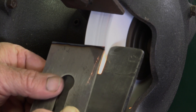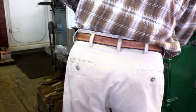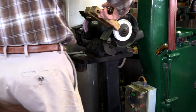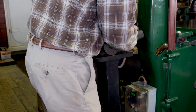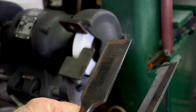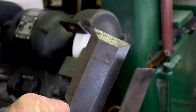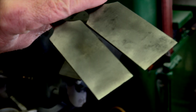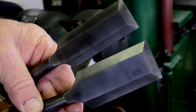One of the other don'ts is grinding soft metals on the stone. Soft metals like aluminum, bronze, and copper will load up the stone — it will actually get hot and may explode. The tools and cutter should also be clean before you grind them. Wood resins, glue deposits, and rust will all load up your grinding wheel and clog up the hone. These chisels were left outside and have a little bit of surface rust on them. Rust is harder than steel and will actually dull your hone, so it is best to wire brush this off before you start sharpening.